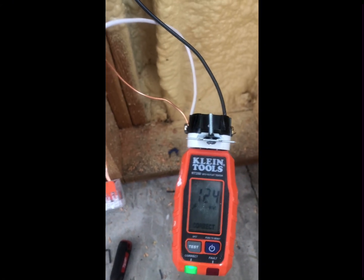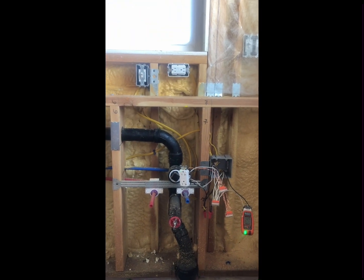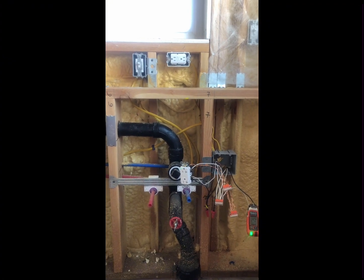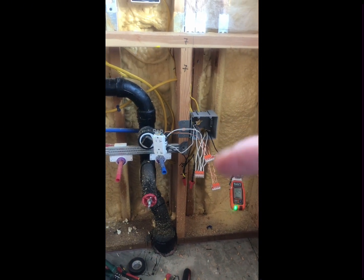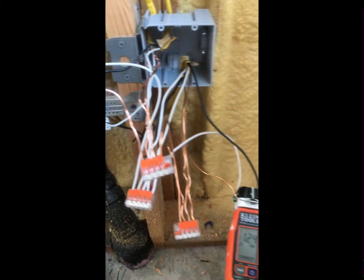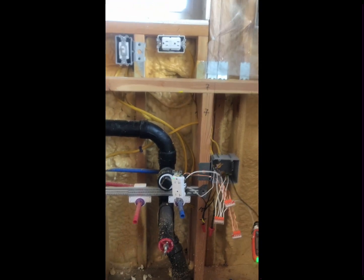Finally we did, and four hours later we got it right. This is Real Estate Investment Management Brokerage Development LLC Electric troubleshooting an Open Ground Neutral reading, which usually means an open white wire but can also be a ground wire issue — all the grounds had to be tied together. We hope this helps you and saves you some time. Thank you.